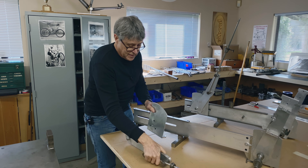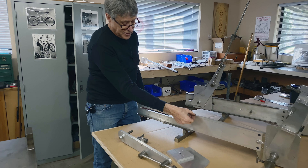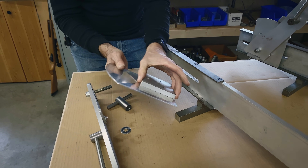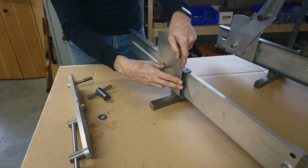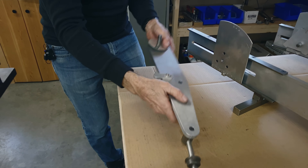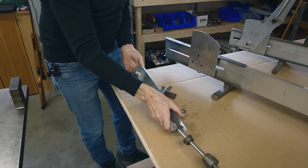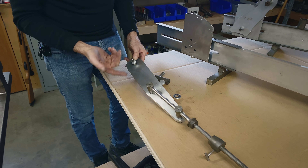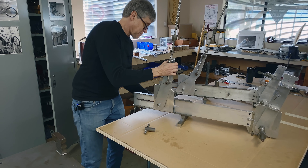There we go. What's going on here is there's a piece of metal — like half by four — and I bolt on these rails, which are inch by three-sixteenths. There's another piece of aluminum that slides in with a little bit of slop, and it slides back and forth. I have a pointer that does the front center, and a tiny shim — just a piece of sheet aluminum — so this doesn't bolt right under there. There's an offset here: if you take a ruler down, it's 45 millimeters, which is what a standard fork rake is. There's not really any rocket science going on here.